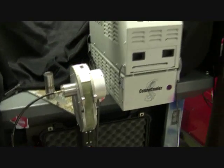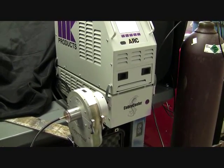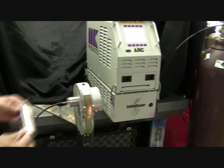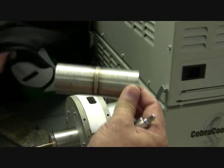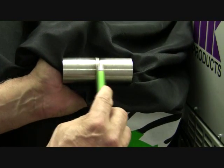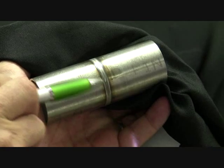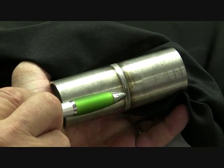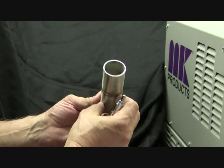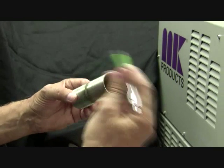One start, one stop on orbital TIG welding. As it continues around, this is a process where you really don't have anything to do until the weld is finished. Here's a weld I recently finished — the two parts are together, they're symmetrical. I have a little convex on the weld all the way around, and you can see where the weld has feathered out from the full weld down to a good clean finish. If we were to cut this tubing down the center and take a look at it, you'd find the weld on the inside is just as bright and shiny as the weld on the outside — and that's what you want. If you've got a good clean purge on the inside, you're going to have a good clean weld on the inside.